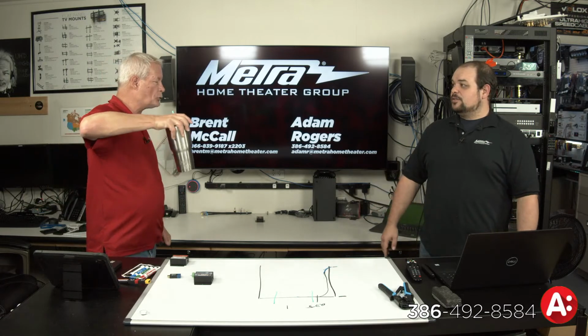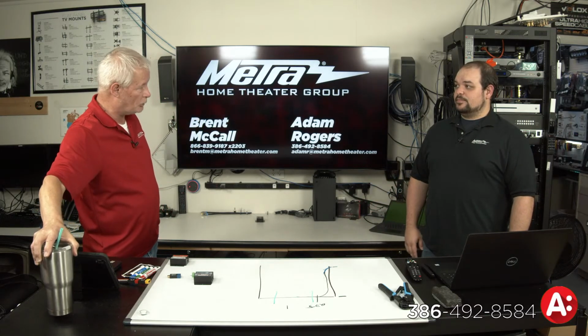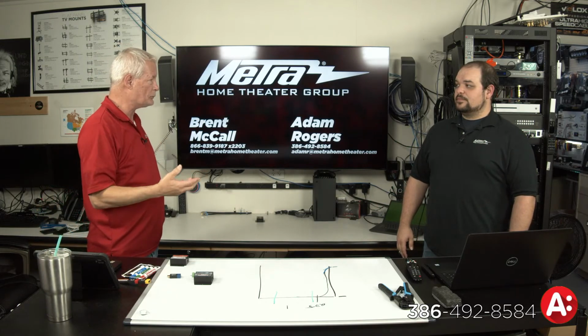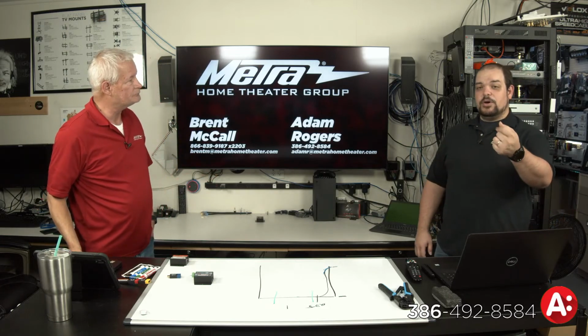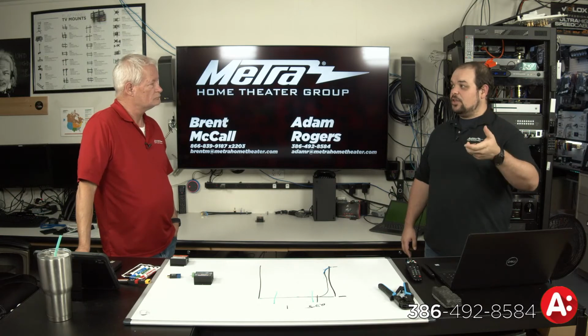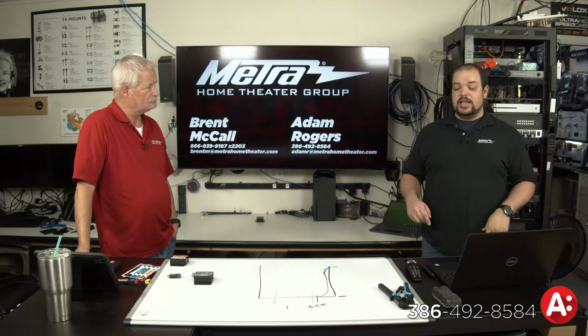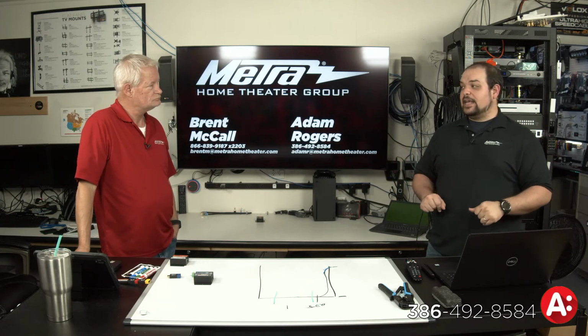Maybe a couple of 12 volt power supplies also, because there are a lot of devices out there, particularly in the IR world, that need those power supplies, and the most likely thing to fail is the power supply. Go onto Amazon and pick up the 12 volt power supplies that have the multiple ends on them, so that you can have those with you to test that. And again, you should be testing and grooming your toolkit once a month.